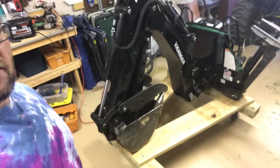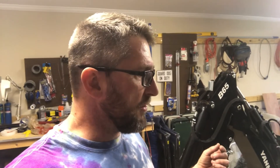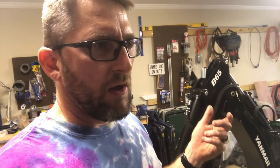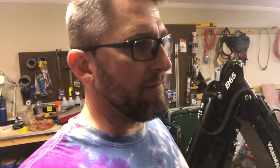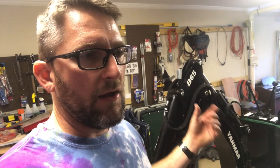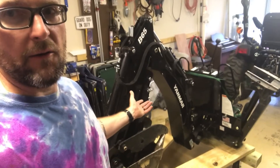All in all, I'm super happy with this build. This turned out better than even I expected. The Harbor Freight 600-pound 6-inch wheels — it's a rubber outer with a polyurethane core — greasable ball-bearing wheels. That's the other thing about those wheels; I paid a little bit more for them. The swivel casters are normally around $18, the non-pivot ones around $16, but well worth it. If you want something sturdy with a high load rating and greasable ball bearings, these things move like butter. It's effortless to move an 800-pound backhoe around my garage.